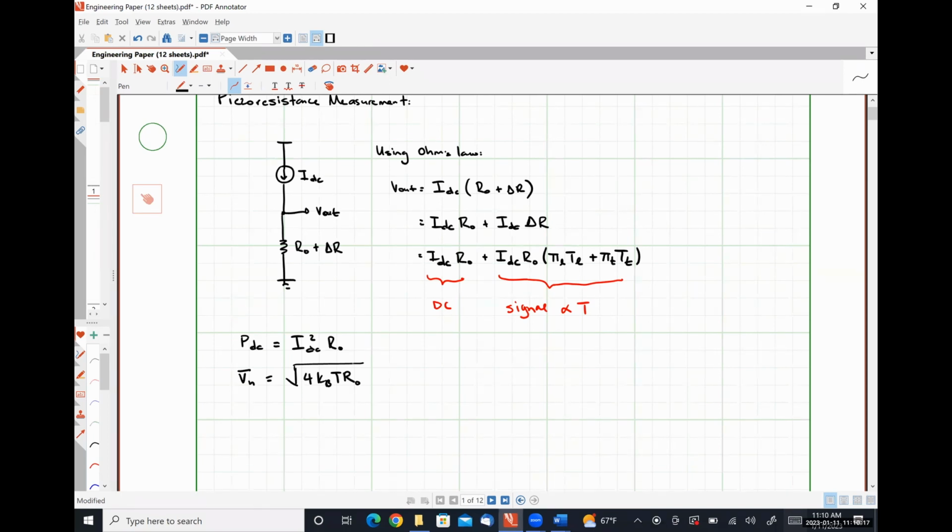Another problem we've addressed previously is the temperature dependence of the nominal resistance R naught may be greater than the piezo resistive effect as well. So that would require costly calibration processes to eliminate that temperature dependency to get accurate signal measurement. So like I said, this simple resistance measurement will work for some applications, but we may have to take into account other things. So the most obvious change we could make would be doing ratiometric measurement, right?